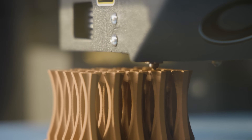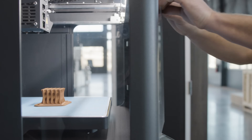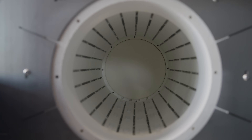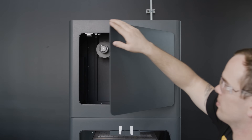After printing, we'll take the part over to the wash station where it'll wash away some of that wax and polymer matrix. After that, our part will be a collection of lightly bound metal powder. We'll then put it into the sintering furnace, which will completely fuse that metal powder together, giving us a part with a density greater than 99 percent.